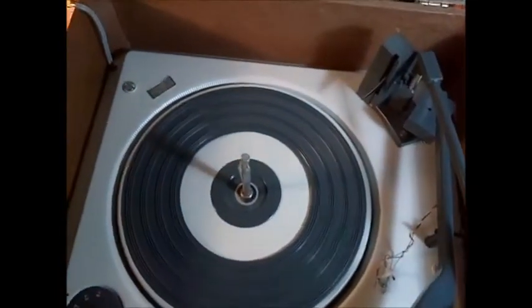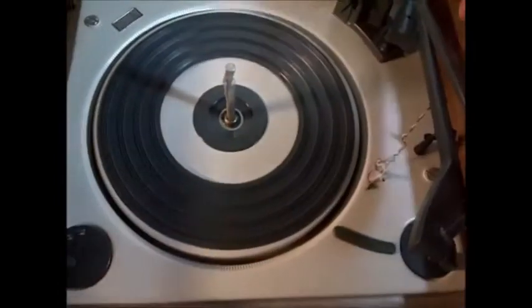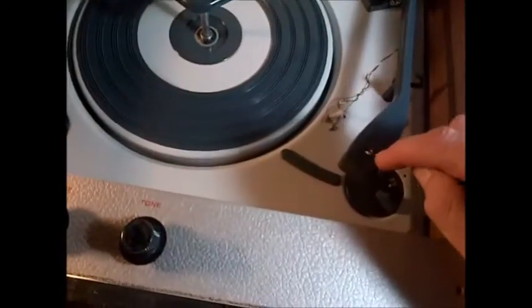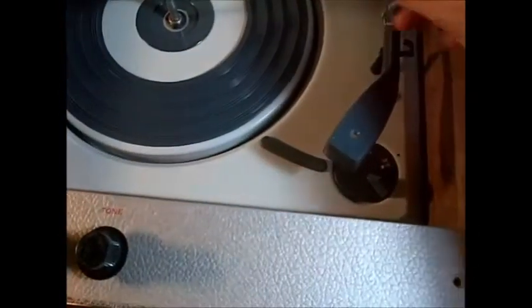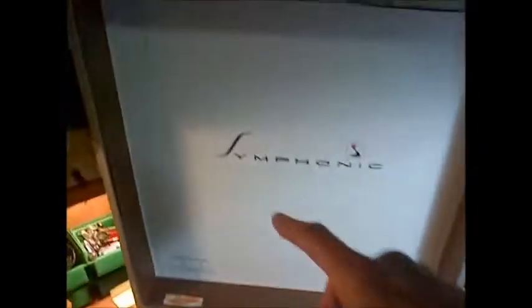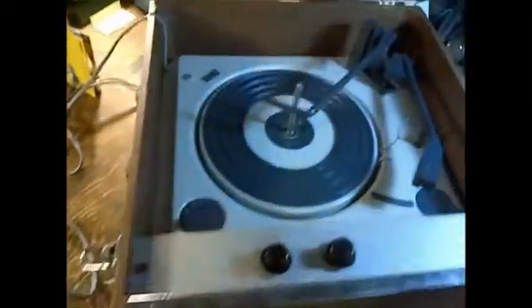Mostly it's knock out the hum. I can't do anything about the cartridge here in my shop — I have to go down to the bigger shop to get a new cartridge. It's very unlikely we have exactly the right cartridge for this; we may have some that can make use of the screw hole. And this is a Symphonic, Model 962. Doesn't say stereo anywhere, but it's got two speaker openings here. That's interesting.